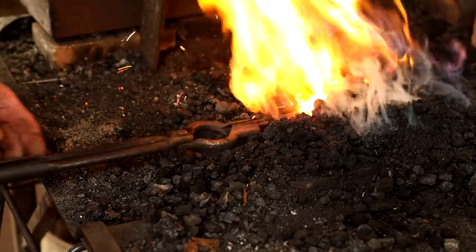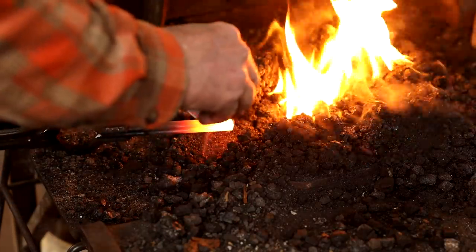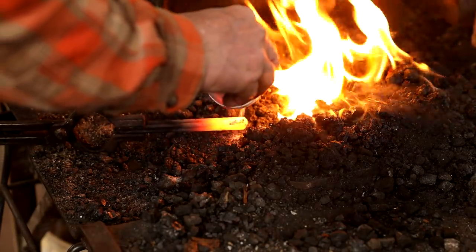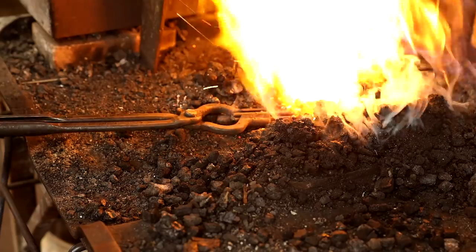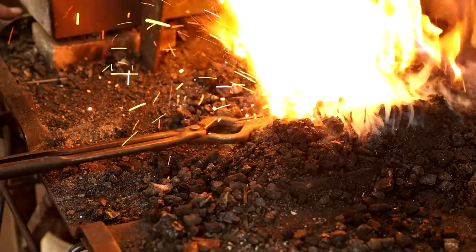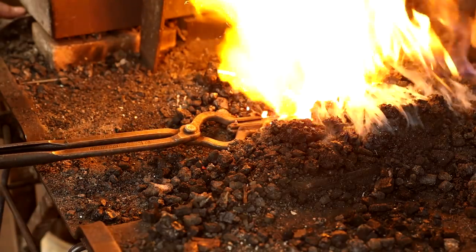You want to keep turning this in the fire to make sure that all five bars plus the core heat evenly to welding heat. With it good and hot, I'm going to go ahead and put a little bit of flux on there. I'm using Iron Mountain flux — it doesn't really matter, whatever your favorite flux is; borax is fine. Now the flux has some iron filings in it, so you're going to get some sparks from the fire, but you don't want sparks coming off your material to be welded — that means it's a little bit too hot.